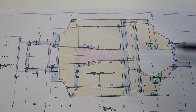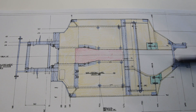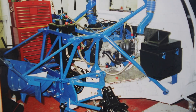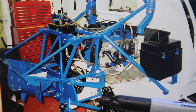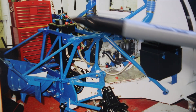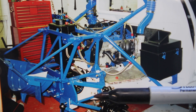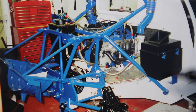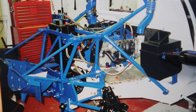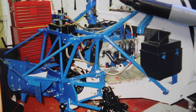The back is all steel, so it can be cut, welded, bodged, fettled and whatever else Ford's rally people required. All the rear suspension builds away from this steel section. The complete rear space frame — with the steel extension at the bottom — has the tops of the dampers, tops of the struts, and upper and lower wishbones all built away from there. This frame then ties up to the roll cage at the top and down to the jacking point in that corner.